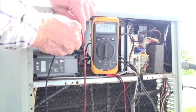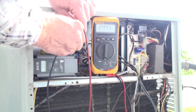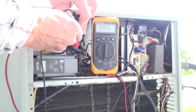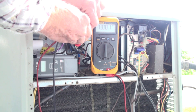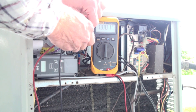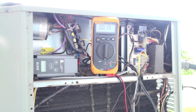We're reading 244 volts, which is normal. Power is out here. If I put the meter leads across and read zero, then I don't have any power out here — that's why the unit's not running. If there's no power here, you're going to have to go back to your disconnect and find out if your fuses are blown.